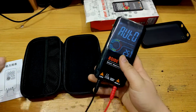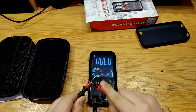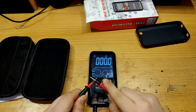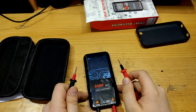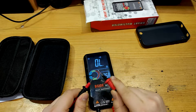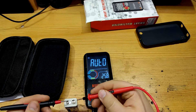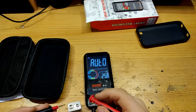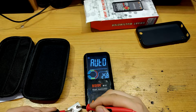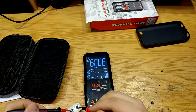Let's move to practice. In automatic mode, the multimeter is so slow that even beeping or continuity test is absolutely unusable. If we however switch to continuity manually, the response is really good — near perfect. Voltage measurement in automatic mode is so damn slow. If we switch to DC voltage manually, then it's quite acceptable.